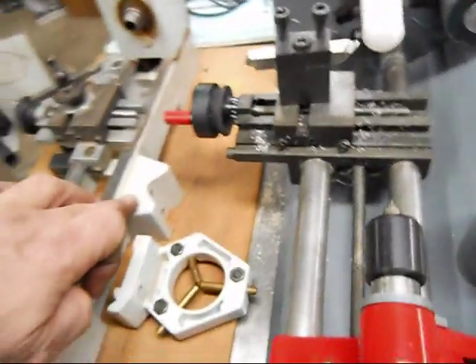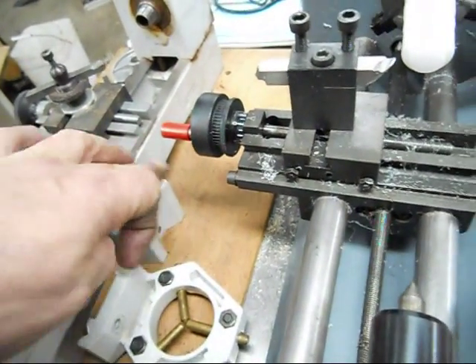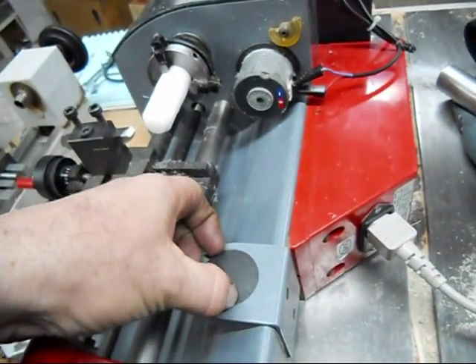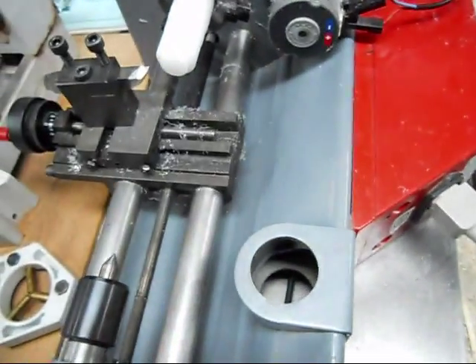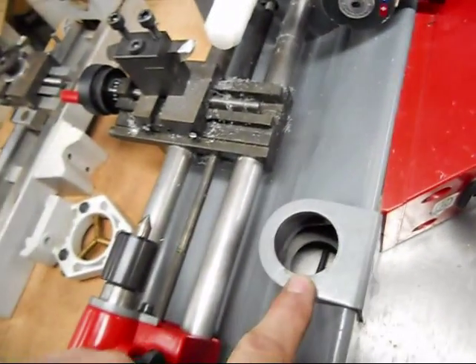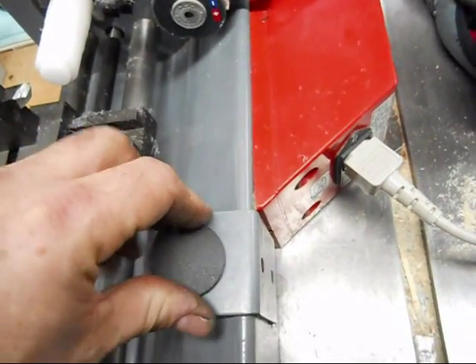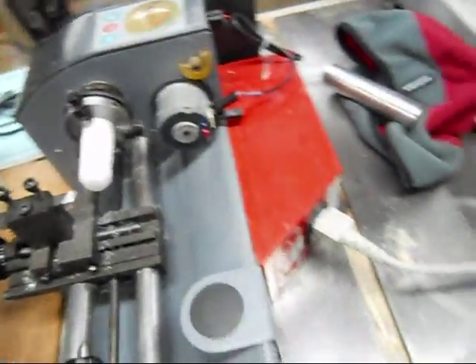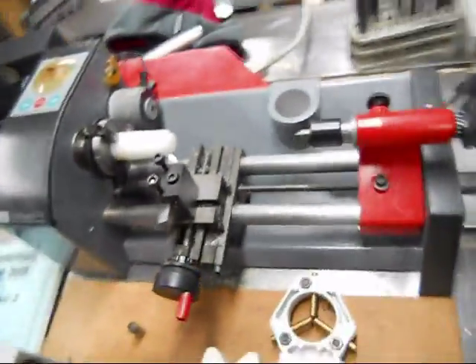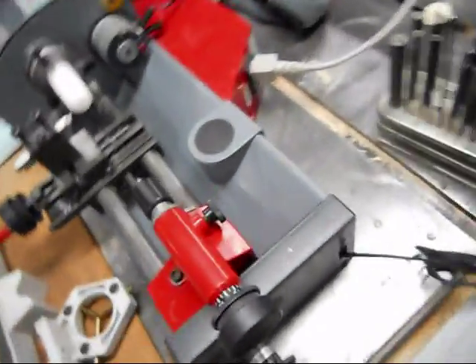The PC has good motor mounting and mill column mounting — it's a casting built into the back of the bedway. The Unimat 3 has a stamped metal piece and a column socket. The diameter on the PC's column socket is probably about an inch and a quarter to an inch and a half — quite large for the milling head. I don't have the milling head for either of these lathes, but they're a nice addition.